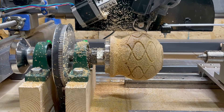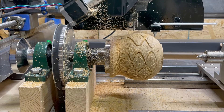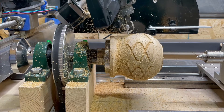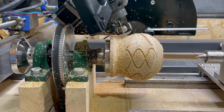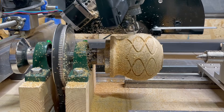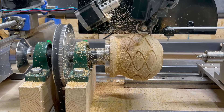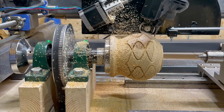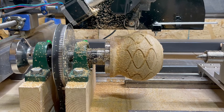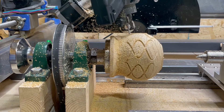As you can see, I've got simultaneous movement of the X, Z, A, and B axes. This was my intention with this project, as opposed to moving one of the rotary axes at a time. Y doesn't come into play, obviously, because I want to maintain the position of the cutter over the center of the work. I hope you enjoyed the video.